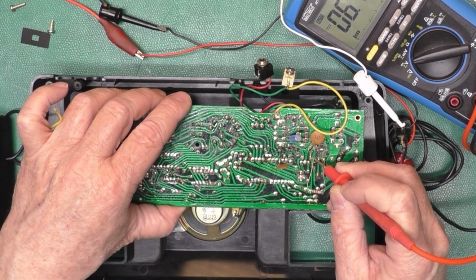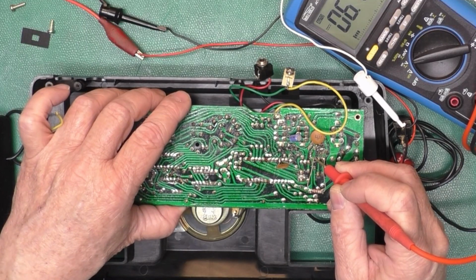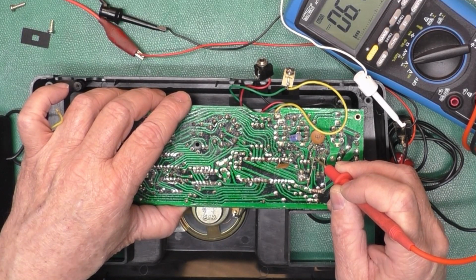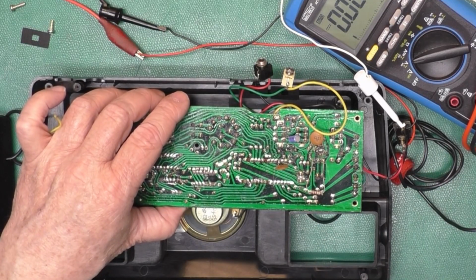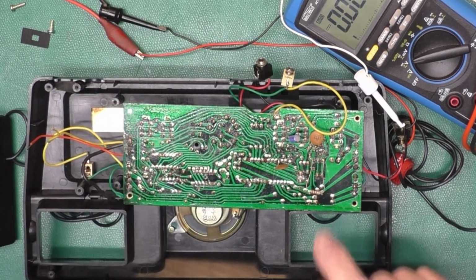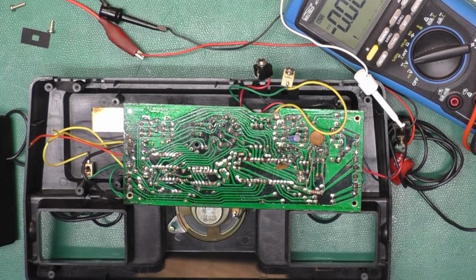Haha. So we don't have video output because the wires are disconnected, but we have a beep and we've got voltage toward the thing. We've got a beeping speaker. So the problem is we need a transistor. It is drawing right at 100 milliamps. So I'll have to find an NPN transistor that will handle that sort of current and pop it in there to see if that will allow it to turn on.